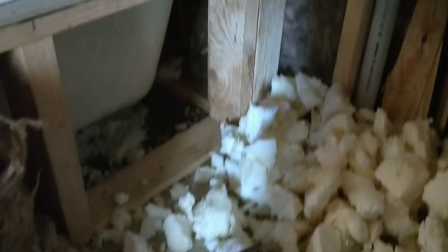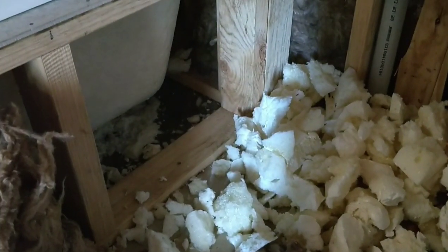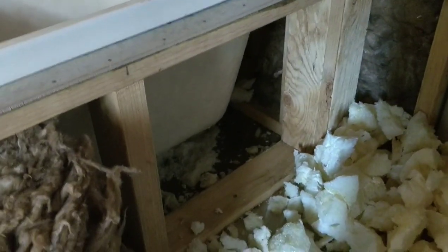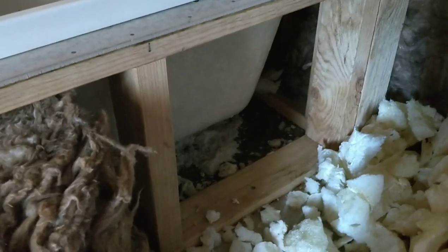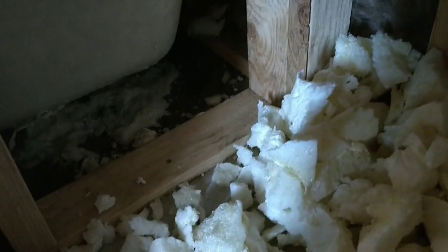Here we are a little bit later and I've finished getting it all out. All I could think of was the final scenes in Ghostbusters — maybe Harold Ramis did a bad job of putting his bathtub in and then got the idea for encasing everybody in expander foam. So don't underestimate the ability for half a tin of expander foam to lift up an acrylic bath. Fortunately when I redo this, I've got water on now, so I'll just fill it up with water. I don't think it's going to lift a hundred kilos plus, so we'll try that again.